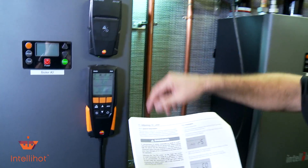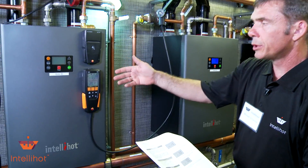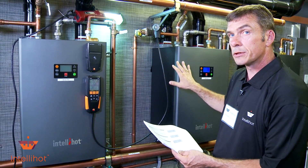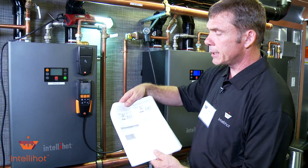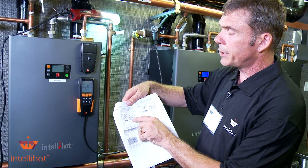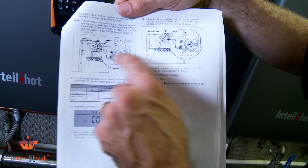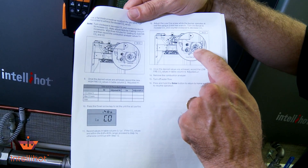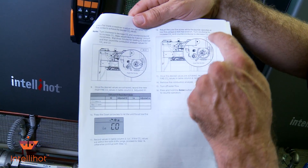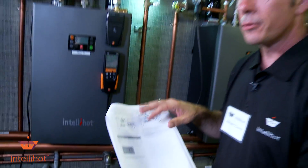When we print this out, it'll tell us what our parts per million will be. They usually want you to run this about three minutes. I already know this one's set up pretty good, but I'm going to show you the adjustment screws and the pages you need to look at, as far as the pictures. That arrow is your high fire adjustment screw — it tells you which way to turn it in the notes. That is your low fire adjustment screw, and it explains which way to turn it. Don't mess with any other screws; they're not adjustable. You just need the high fire and low fire.